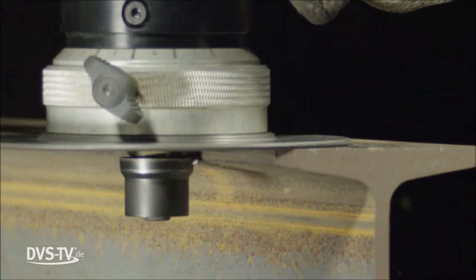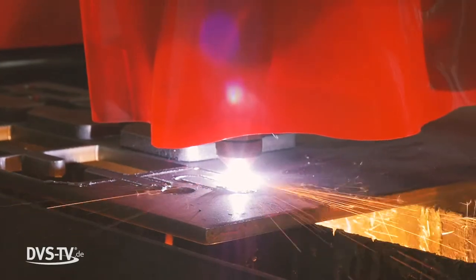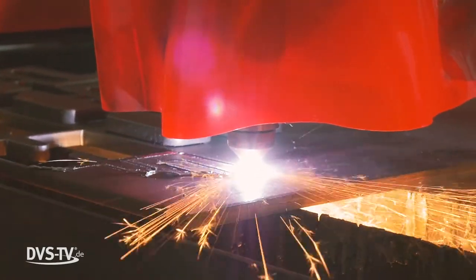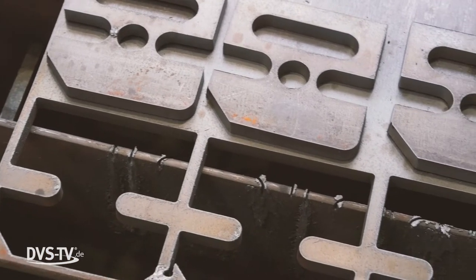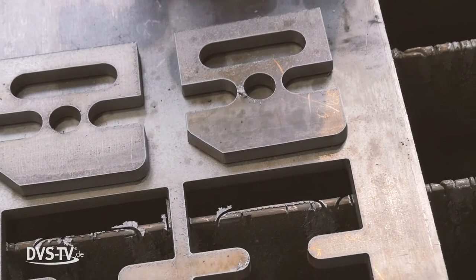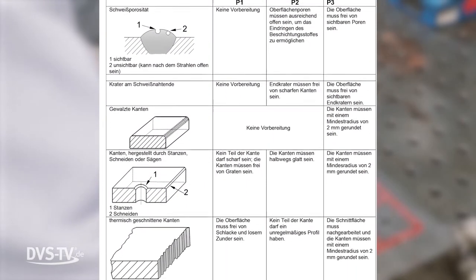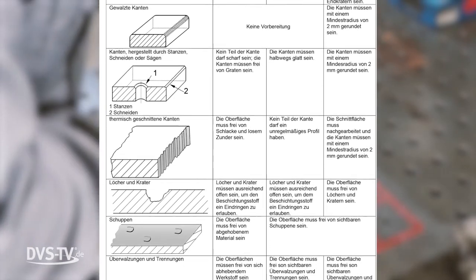What's left is the milling process. After thermal cutting processes, the edges are hardened, oxidized, and carry scale. Therefore, these surfaces have to be reworked — hardened and oxidized surfaces have to be removed. DIN 1090 requires that hardened edges and stress peaks must be minimized or eliminated as much as possible.